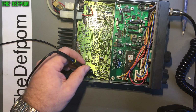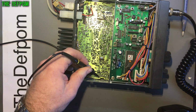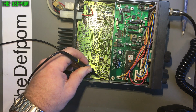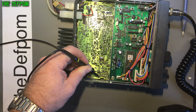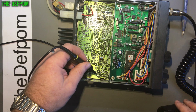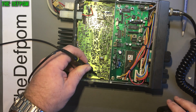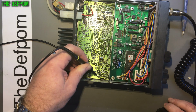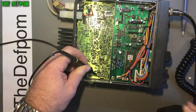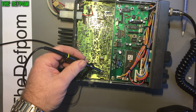Well, it's actually a resistor, I think, from there. But okay, so that one there is 38 megahertz, 38.6975, whatever, depending on what mode you're on, which is fine. And when I go to TX, that's the output here into that filter network. That's 3 tuning cans in a row. And at that point there, if I transmit, I'm getting 38 megahertz coming out, which means it's not mixing. And that's usually a result of a missing signal.